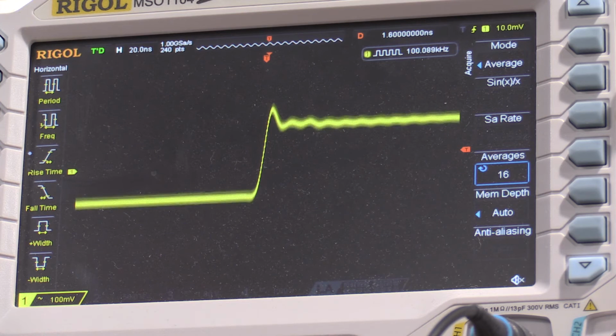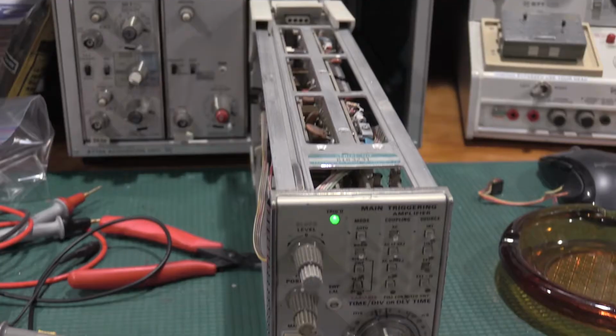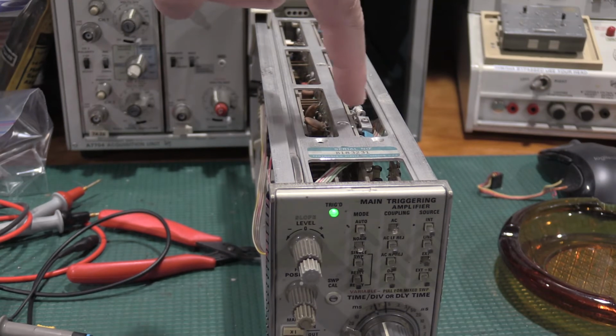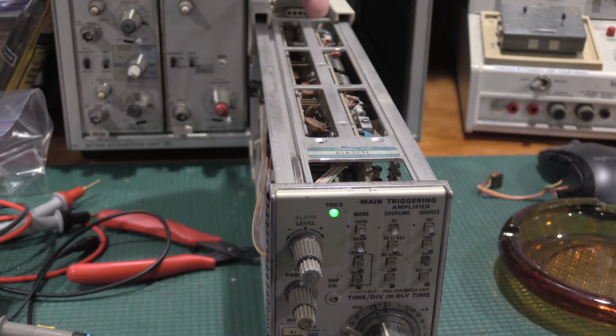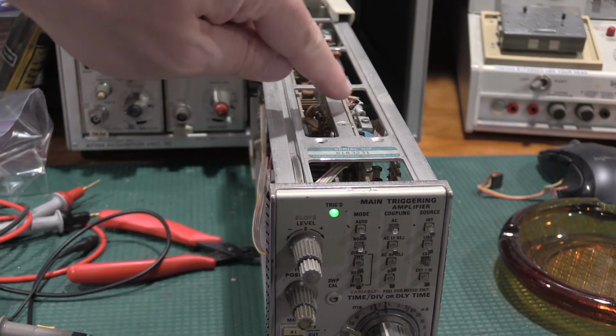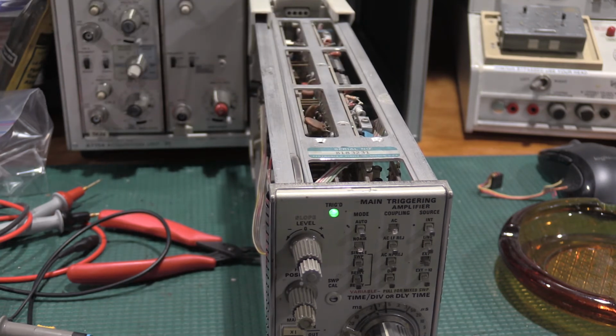Now I need to find 315. So that's probably going to be another schematic find again. Once I find that, I will let you guys know where it is, and I'll be back. Okay, same deal. This is the transistor pack right here. The test point is the base of Q320 on this one. So where it was this transistor on the delayed, it's the further one back on the main. So I'll get this GoPro hooked up, and we'll take a look at the trigger.